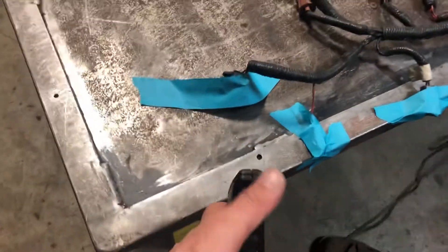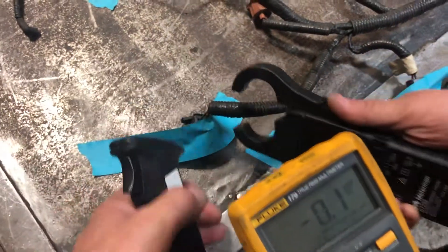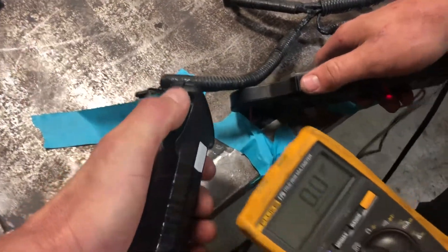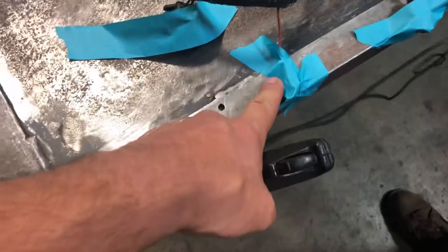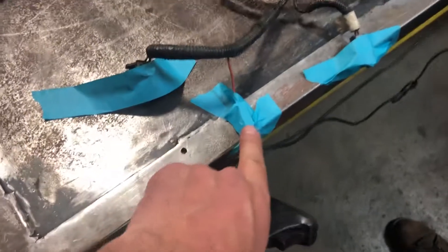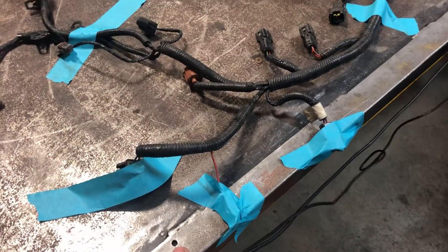You've got two possibilities here. Which one do you want to test next? Let's try this one — you go around that one: one amp. So you go around that single wire right there: 64 amps. Boom. Your short circuit is on this wire, and that's the end of it, so it has to be right there. And that's exactly how you would isolate a short using a current clamp.